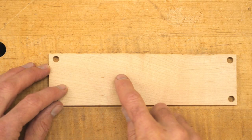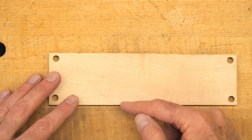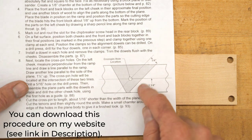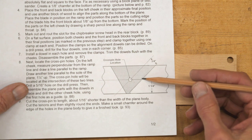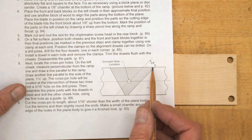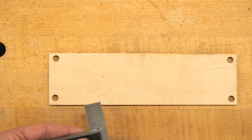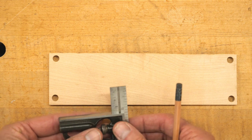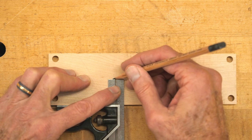The cross pin hole is located on the side. You want to come up one and a quarter from the bottom — that's shown on the dimensions here — and three-quarters from the bed. It's important that you come up perpendicular; some people measure in the wrong direction, which is not going to work. So I'm going to draw a line one and a quarter up from the bottom. I've got my combination square set for slightly less than one and a quarter, since the pencil thickness will make up for that.